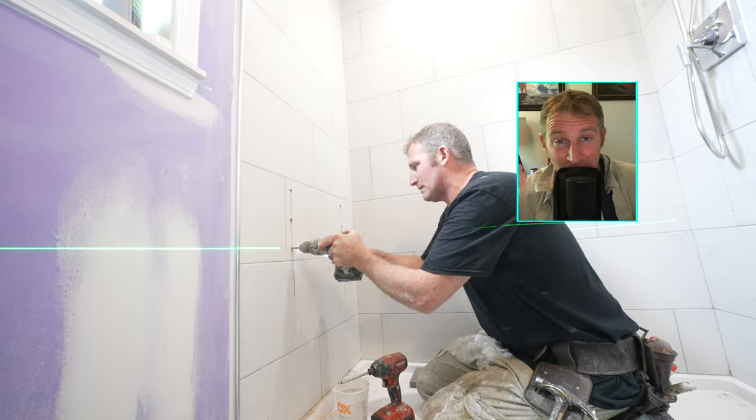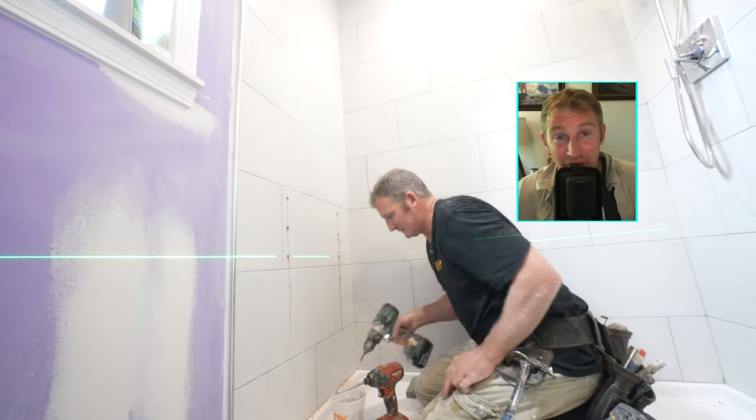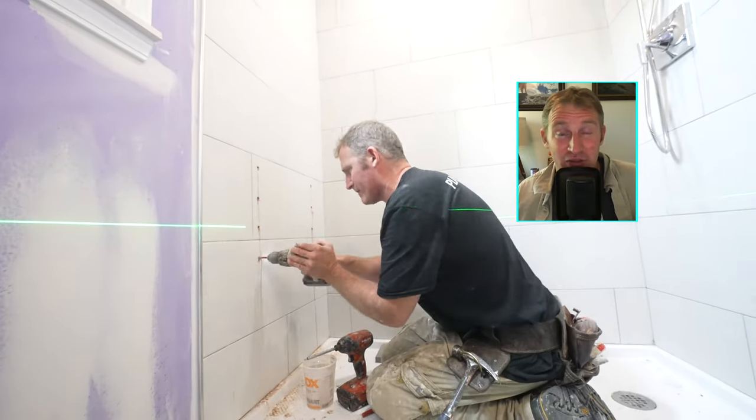The only thing I would really highly recommend is you keep it cool. So every time that you drill a little bit, cool it down, have a little cup of water, dip it in there, and then continue the drill.